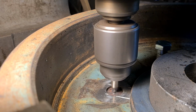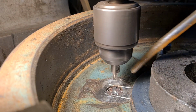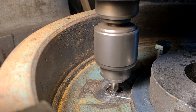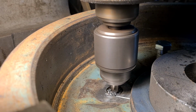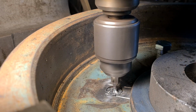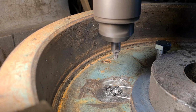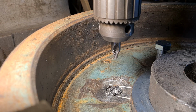So I'll just get a bit of a start, and then I'll put a drop of juice on it, because this is the 12mm plate we're going through here. And if you ain't careful, the tip of the centre drill sort of warms and expands it, and then rubs into the steel, and it can break the tip off. And yeah, that's about there really. Yeah, so there's the centre. So what I'll do, I'll change the drill and then I'll come back.